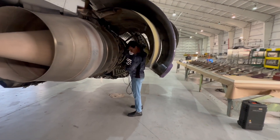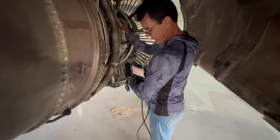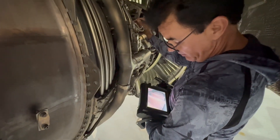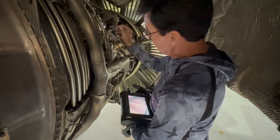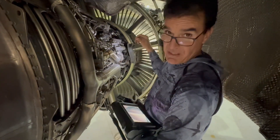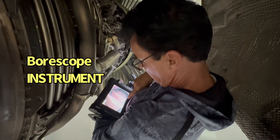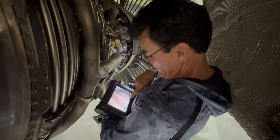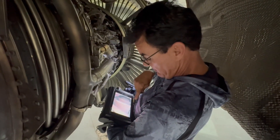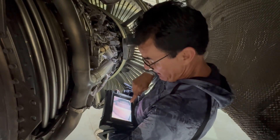What's going on guys. So what we're doing here is we're doing an inspection from the outside and looking to see how it looks like on the inside. With this light and this camera stuck up inside the engine — this is a previous recording so we've already inspected the engine. As you can see it looks pretty sharp, except for a little coating loss, which is thermal barrier coating, TBC — basically paint to protect the blades. These blades are magnified five times the original size.